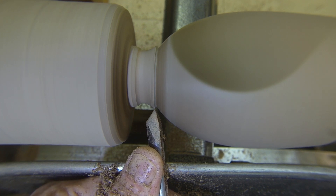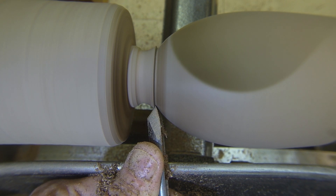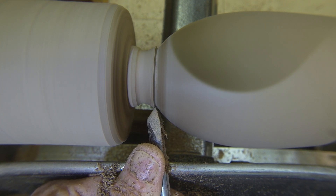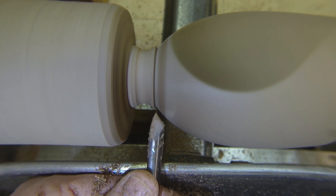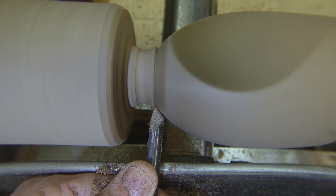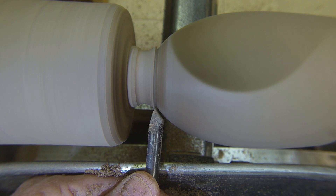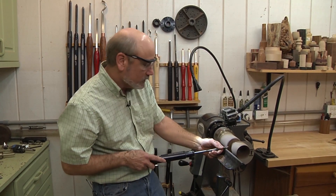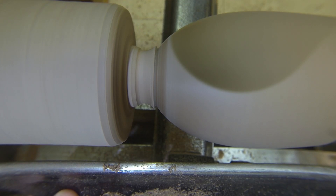Get the bevel going exactly where you want, then you can push in and pull out like so. You want to make this cut so clean that you don't have to sand it, because you can't sand it — that's the issue with this. You want the tool to make the entire shape and you want to make it beautifully. So I got the tool really flat, just like an Easy Wood, just to scrape that away. That's as good as I'm going to go because it's giving me enough room now to start making the rings.